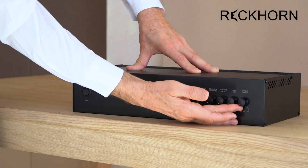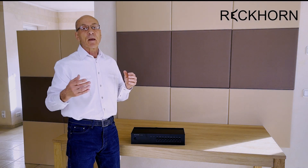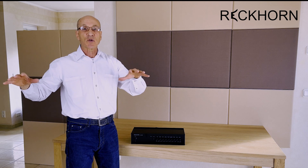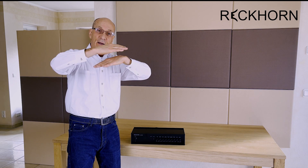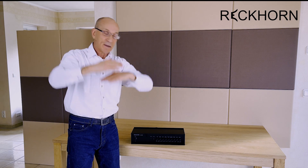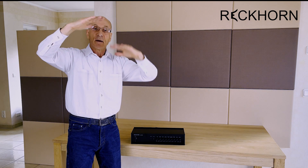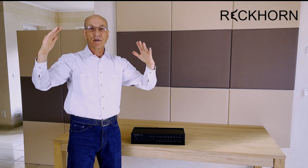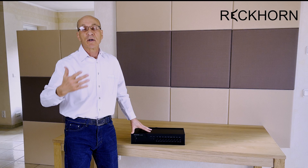There's a phase control here — it continuously turns the phase from zero up to 270 degrees, and it must be tested by listening. The phase is important for the frequencies coming from both the subwoofer and satellite speakers. You cannot cut so steeply that you can say 'that's the sub, that's the satellite' — they are overlapping. If both speakers are not in phase, they can cancel each other, creating a hole in the frequency response, or they can combine to create a peak. You need two people: one listening, one turning the knob to find the best sound.